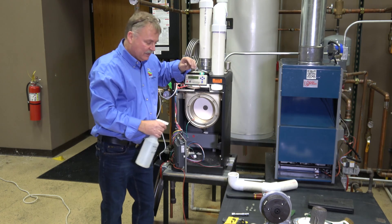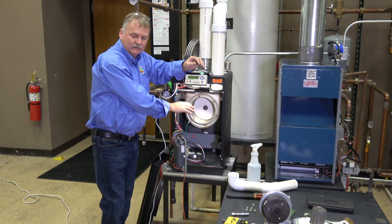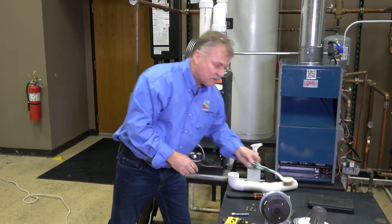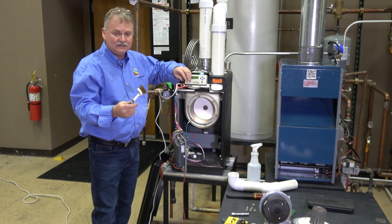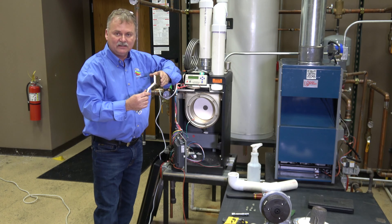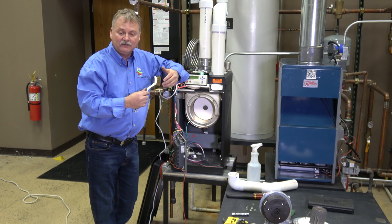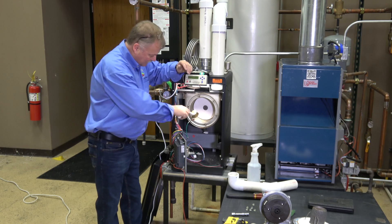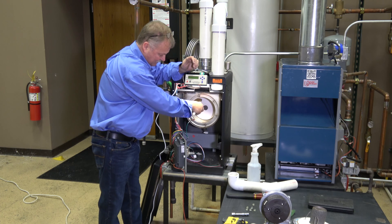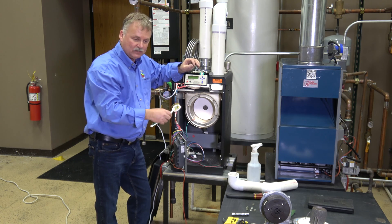Let that soak a few minutes. If you walk into a boiler that has a lot of material on the bottom, don't wet it — get your shop vac and suck it up. So now it's been two or three minutes and we've let that coil cleaner soak in. Get your brush — this is nothing more than a barbecue cleaning brush. You want to make sure the bristles are brass or stainless steel. Never use a steel brush on stainless steel — you'll actually scour the metal and that will allow it to start to deteriorate. Take your brass brush and work that coil cleaner into the heat exchanger to loosen up whatever crud is there.